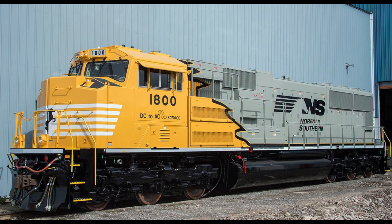In the years leading up to the Norfolk Southern SD70 rebuilding program, it was often a matter of curiosity as to whether or not an SD70 or 75M would be equally as easy, and when I say as easy, that's a relative term here, to convert to AC traction. Perhaps converting them to Max instead would have been the cheaper alternative due to the fewer inverters that were needed.